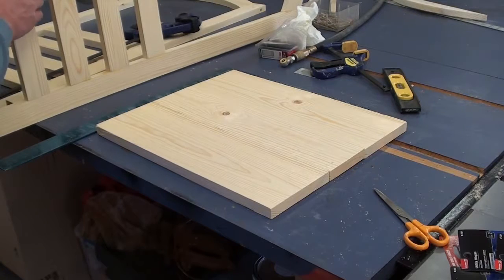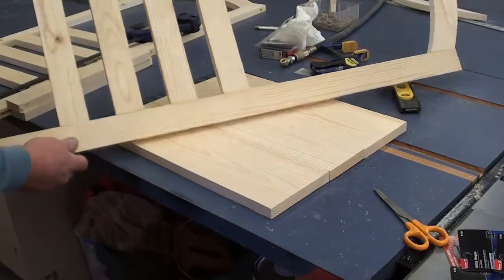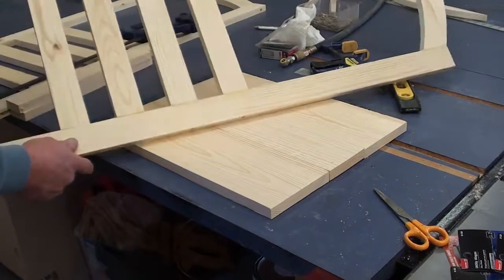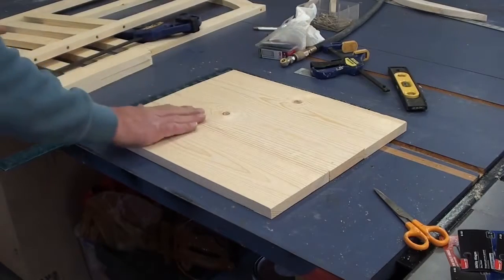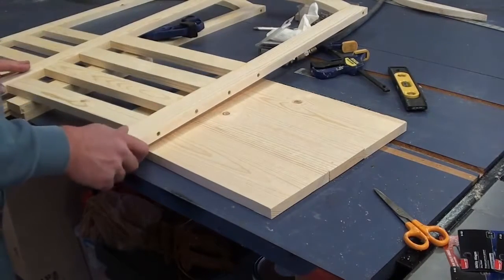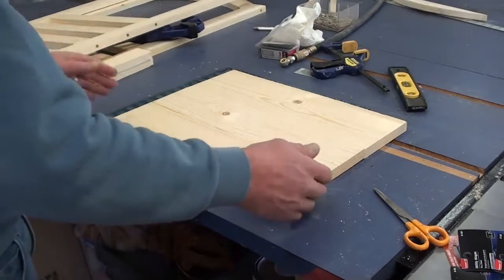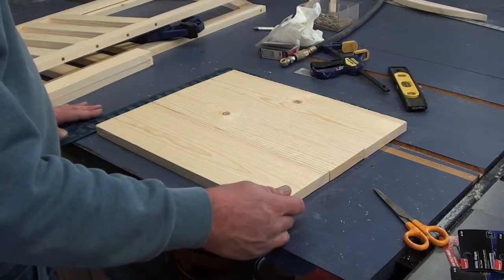Also, we're going to make this, using hinges, we're going to make this whole thing collapsible so that it would fit under a bed or between the fridge and the sink or whatever. So we'll get to the hinges part in a minute, but because this platform is going to sit between these rungs, and the stretchers we're using are 16 and a half. That's why the platform is 18 inches wide, so there'll be a 3/4 overhang that matches the thickness of the wood.